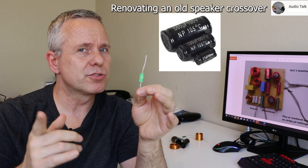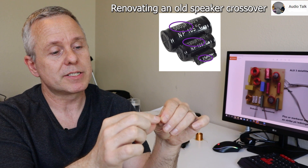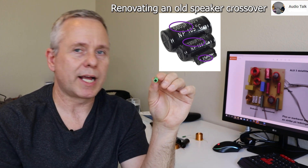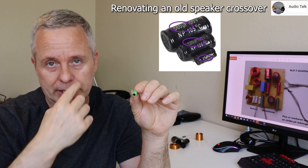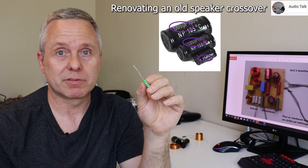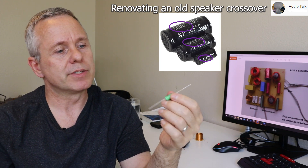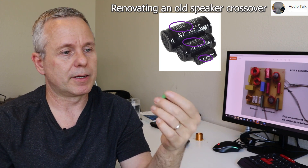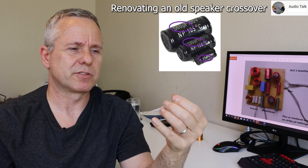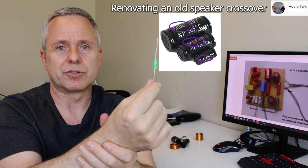I'd say 15 or 16 years even if you were really good to your speakers — usually replace them. Read the value on the side in microfarads (µF) and order a new one. It needs to be audio grade, so find a store that deals with speaker drivers. Don't buy from a general electronics store unless you really know what you're doing. They're not that expensive, particularly if you're just changing to another electrolytic capacitor.